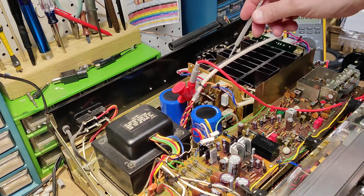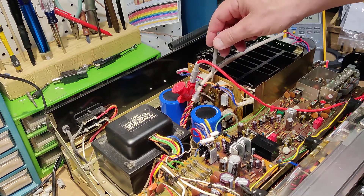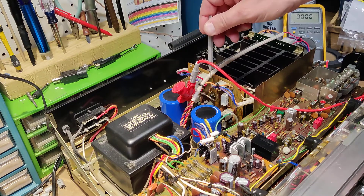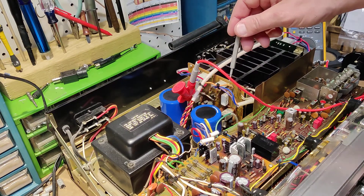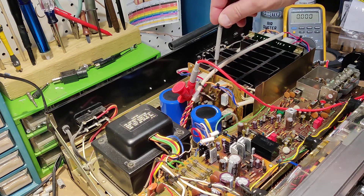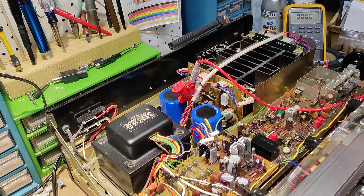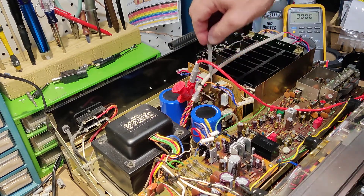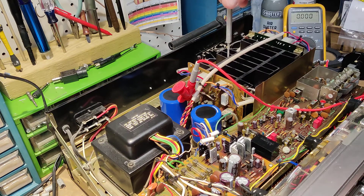What we're going to do is I've adjusted VR1 and VR2. VR1 is the white one if you're looking at your power amplifier board — it's the one closest to pin 10. VR2 is further away from pin 10, and it's blue. We're going to set VR1, the white one, all the way counter-clockwise on both — I've already done so. And we're going to center VR2, the blue one. Turn it fully left, fully right, get an estimate of where center is, and get it roughly on center.